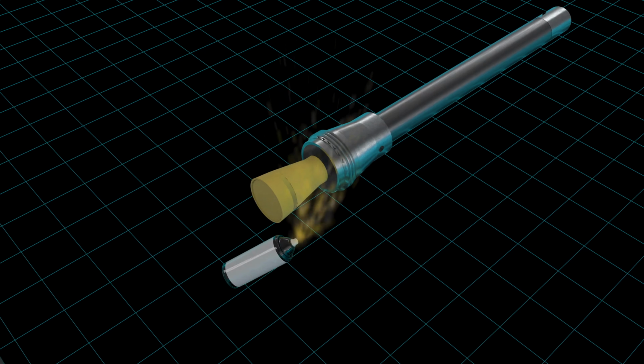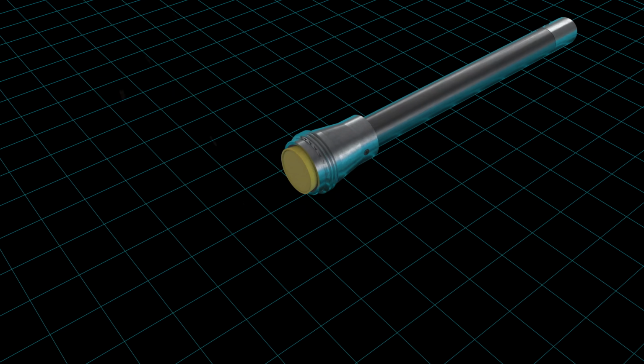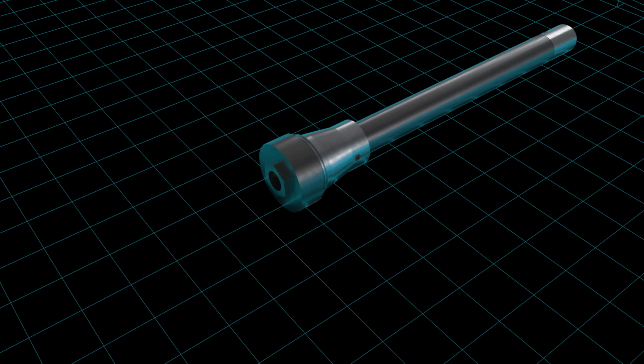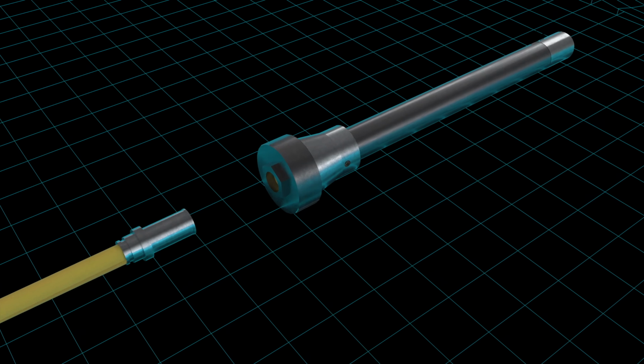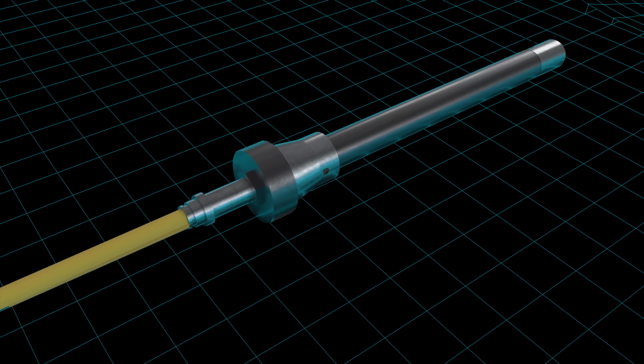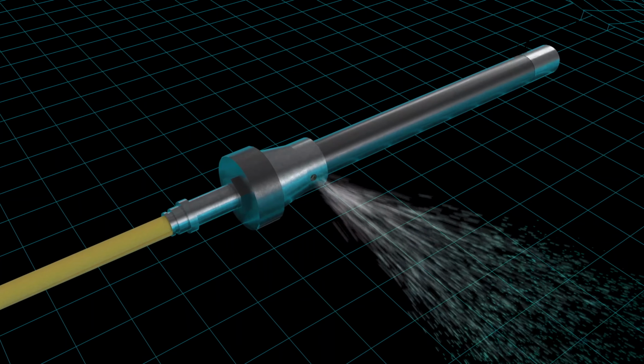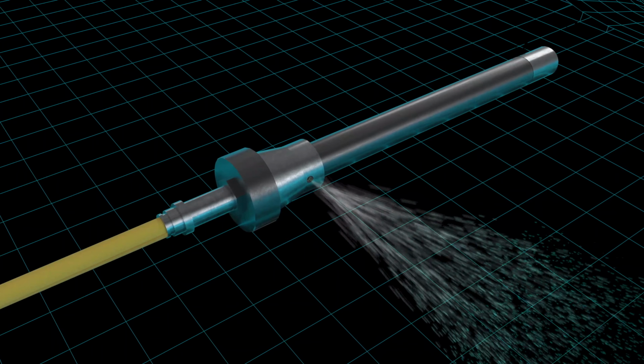Warm up and lubricate the foam seal with an environmentally friendly grease to prevent any damage while loading it into the inner tube. Finally, thread the loading chamber cap and connect it to your water supply, applying low water pressure to load the plug. When water exits the loading chamber's indicator hole, your Piercepoint TTB plug is loaded and ready to deploy.